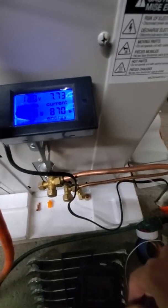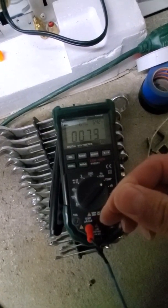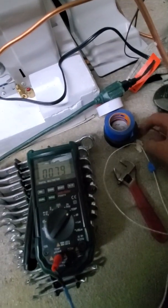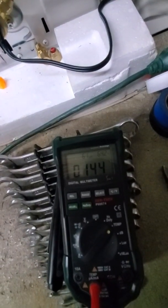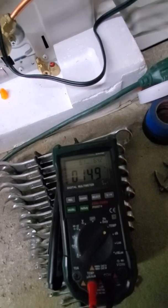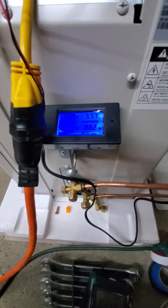I'm going to show you the temperature sensor — watch, grabbing my finger — it'll jump up to like 80 or 95 degrees. I've got a piece of foam so my fingers don't burn off. I'm going to show you how hot the discharge temperatures are. I'm going on the discharge pipe now — 150 degrees, and that's not even at full capacity. There's still room for about a 15% rise.